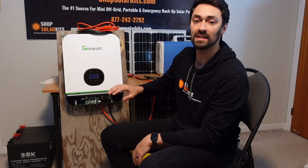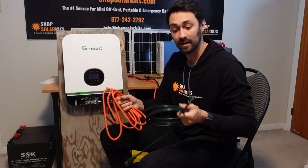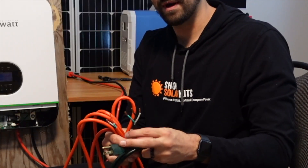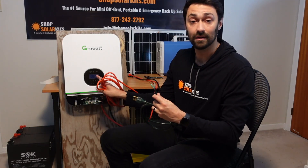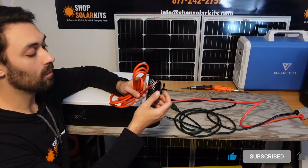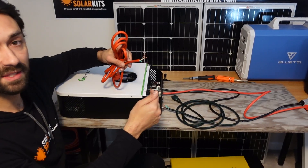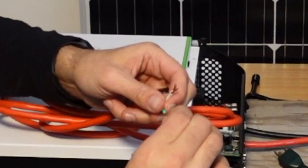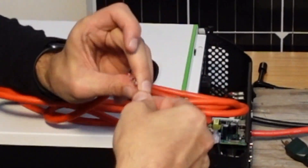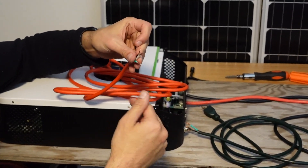The simplest way to do AC in and AC out is to take a household extension wire and cut it in two. You're going to have a male and a female end, and that's what you're going to use for the AC in and the AC out. As you can see I've got a pretty thin extension cord, so once I've stripped my wire you can see there's very little copper wiring here, which isn't going to be the best connection when you hardwire it down. So what I like to do is twirl it together, fold it in half, and twist it back together — that will allow it to connect much better when you wire it down.